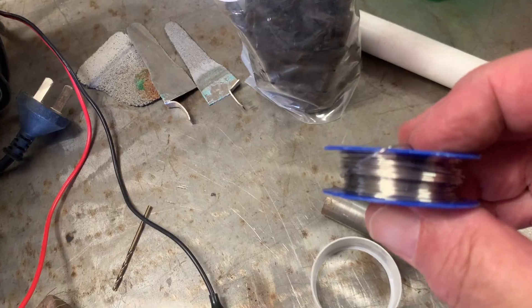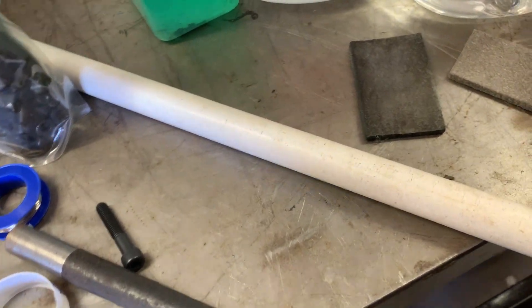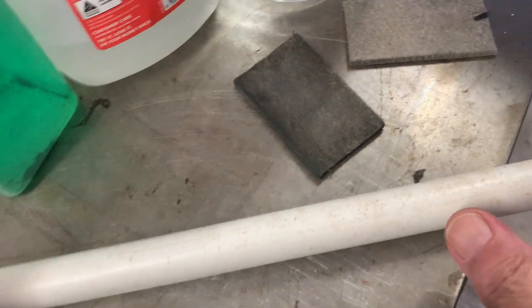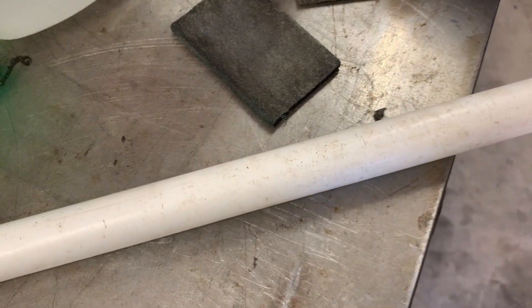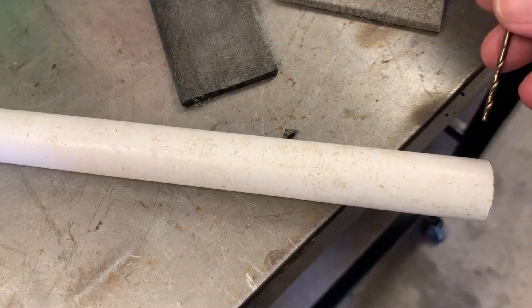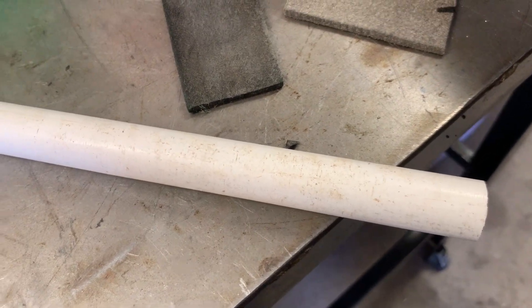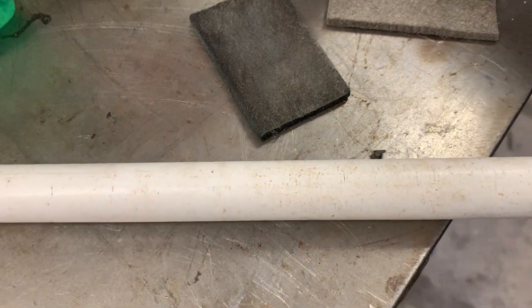You need some 0.1mm nickel wire to make those little nickel contacts that sit on top of those little round pads. With a 2.5mm drill bit, I cut them so they fit in that container, which was about 110 millimeters, and then you just drill a heap of holes randomly all the way through the thing. Make some wider holes with pins you can use to isolate it, or you can glue the top in — and that's pretty much how that cell was created.